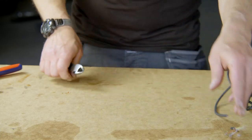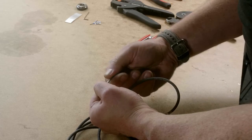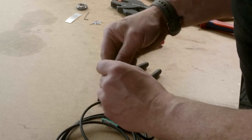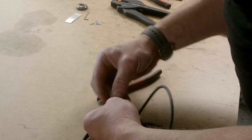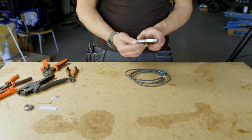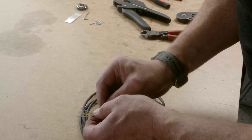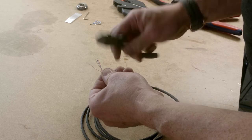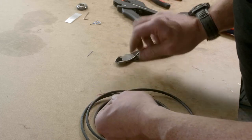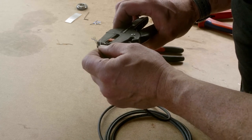Cut the cable to the appropriate length and strip the outer protection. Remove the shield wrapping. Use the picture you took earlier and determine what cable colors you need and cut the unused off. You will need white, brown, green, and gray. The others are not needed. Strip the end of each cable and fit end sleeves.